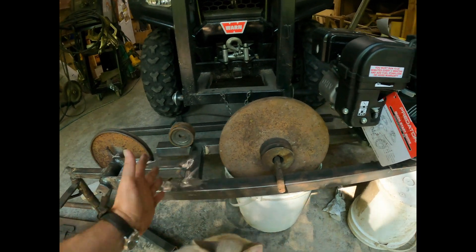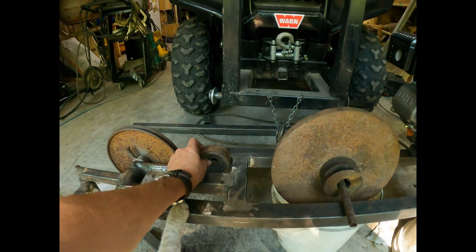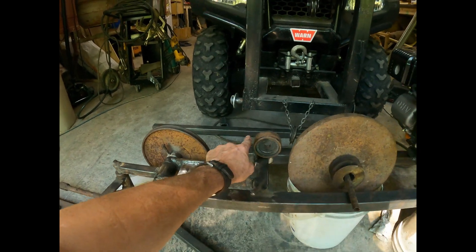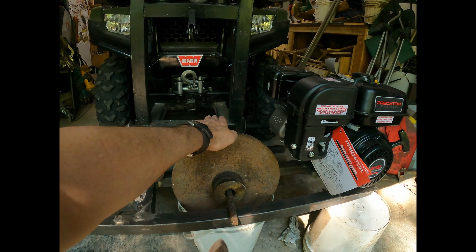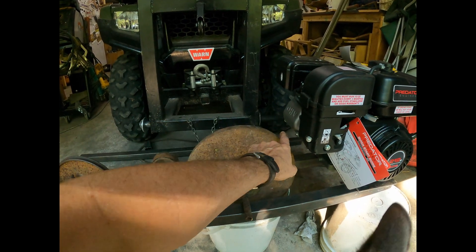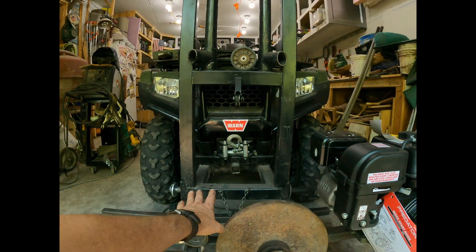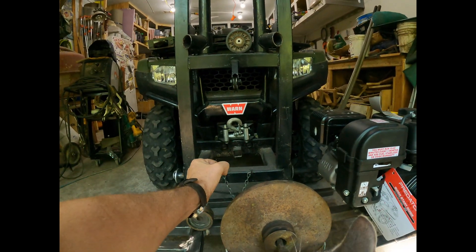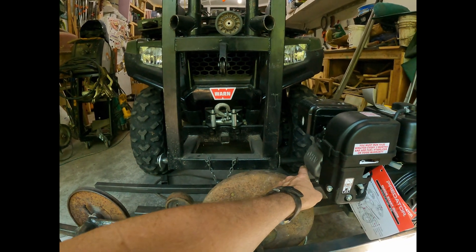The 25 pounds will help. Here's how it's going to go: I'm going to put that idler — which actually came off a car — up like this to take the belt. The belt will run around the pulley, up onto the idler, and then straight to the engine, come around the engine, and this will go on the other side. I might put an idler down here too, and I might change the belt idea. That idler is the one that's going to go on the lever to tighten the belt. I don't know yet if I'll have it pushing down.